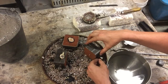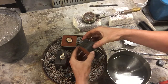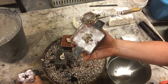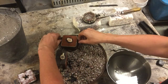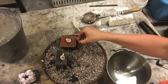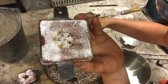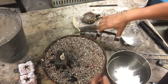So we're going to put one nut down there and another nut over here, move that piece of pumice, and then we're just gently going to open our piece. And there again you can see that we have our charred out mold and the cast part. We have five lovely vents — you can see those right there — and once again a charred star. So we'll set that next to the other one.